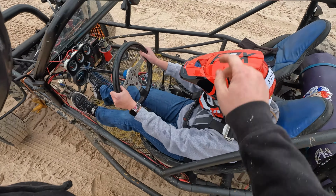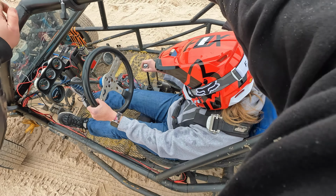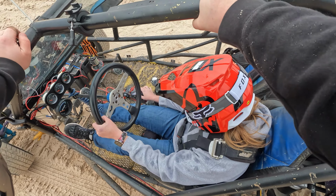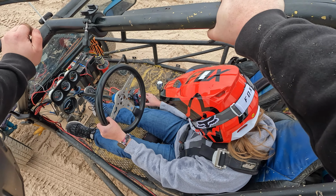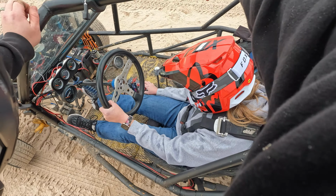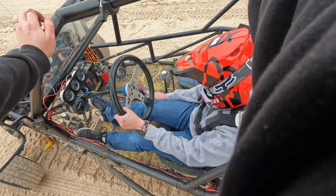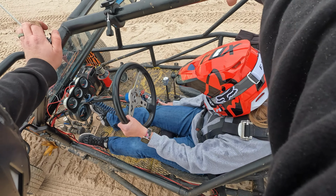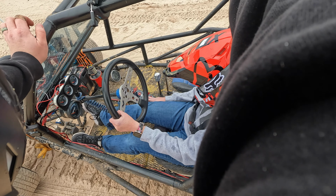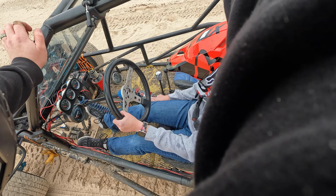So, it's out of gear. Move the gear shift around. Yep, not in gear. So, what you can do is turn the big key on. The top red switch down below, flip that on. Not that. That's your start. Just go down. That right top one, right there. Flip that on. So raise the red thing, pick it up. Yep. Now flip the switch on. Now you have ignition. Leave it on.